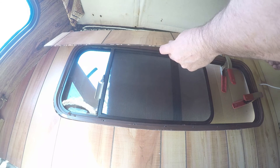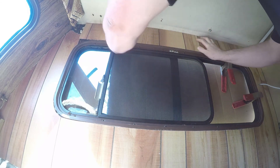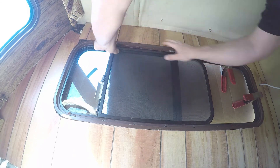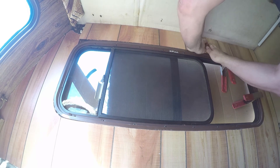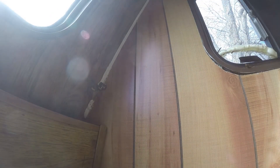We're just going to put on our last little panel here and stick that into place. I've got a little corner piece there — I had to piece all this stuff together. I did not want to have to go buy a new panel for that little stuff in the corner, and again it's all going to be covered by the curtain cover piece so we're fine there. I'm going to put a piece of trim here and I'm just using some more of that liquid nail. Be careful not to use too much because if it squeezes out it'll drive you crazy — I had to get in there with a chisel to get it all cleaned out and make it look nice.